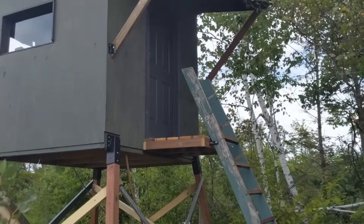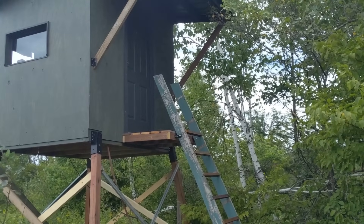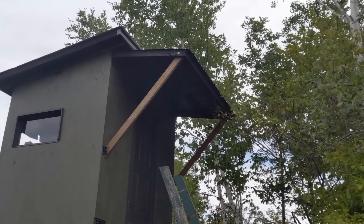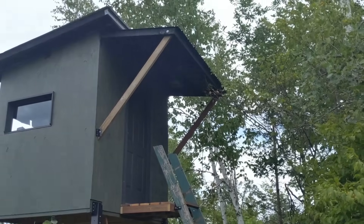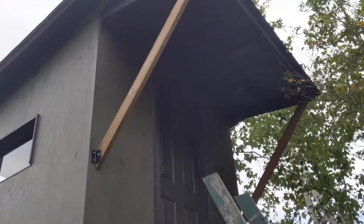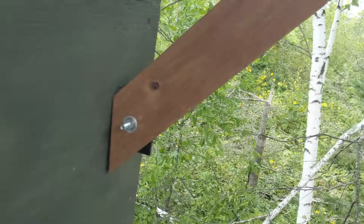I put a little landing up there because I'd like to have a step coming out before I start going down the ladder, and I left the ladder a little longer so I've got something to hang on to. I also went a little further and put about a 3- or 4-foot overhang on there, just to keep snow and ice from building up on that platform and hopefully off the steps. I made a couple metal brackets for the bottom, picked out a couple of stout treated 2x4s, and used them for the brackets. Here's a closer look at those gussets — I've got them bolted through and also one bolt on top.